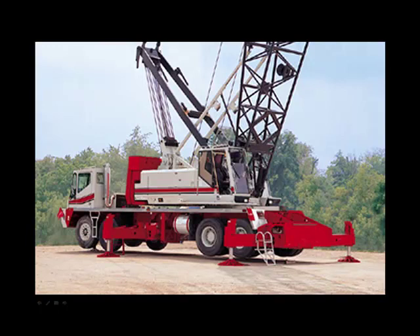There are many similarities with this crane, but the most noticeable difference is that this crane is mounted on rubber tires, and this is called a truck-mounted crane. It also has the lattice boom, which needs to be assembled on the job site. And when the crane is actually making a pick, it must be supported on its outriggers, as shown in this photo. The crane has very limited capacity on the rubber tires and should never be used on its tires, so the outriggers must be put in place before you make a pick.